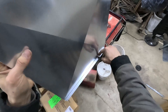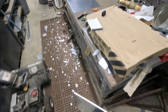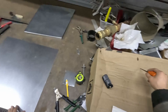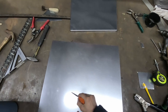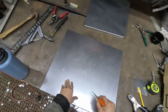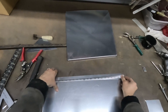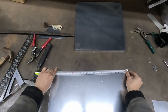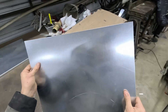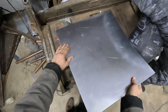There's our back panel. This will screw right down to the furnace and connect with S-slip on the top. Now we'll do our left side panel — 22 here on the bottom, adapting to 17. We'll mark this so that we know this is the inside. We're staying straight on this edge; this is where the angle is going to be. We'll measure 17 plus 2 inches for the female lip — 19. It's really hard to see those marks on camera, but I don't like sharpie all over my transitions.